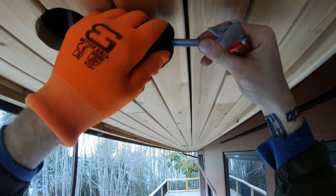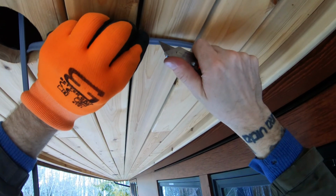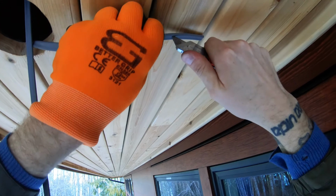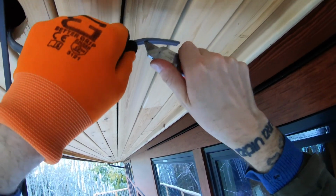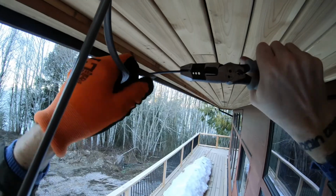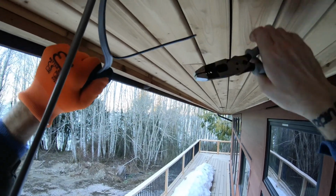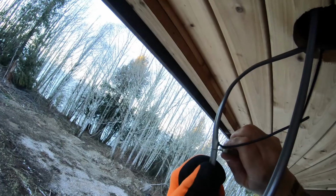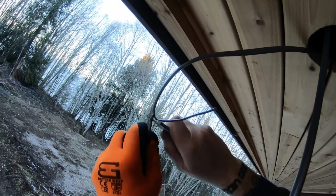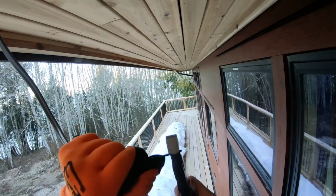Last wires. Easier. This helps. You dive in right at where the ground is, and it's not hard to force it through. And pull it, and pull about 4 or 5 inches out. And I cut from the middle so that I'm on the ground, so I'm not marring the neutral. Definitely not as easy as Romex.